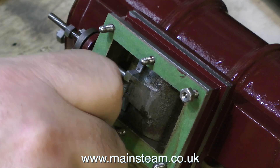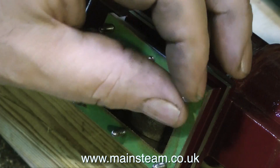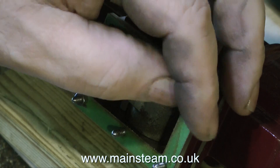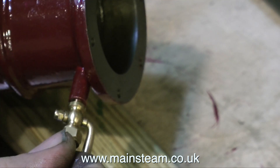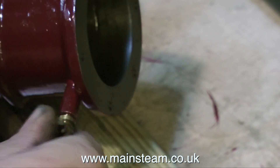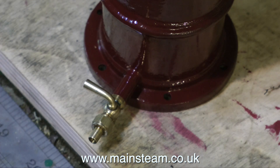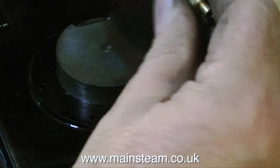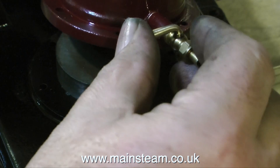I'm taking notice of the 'T for top' marking on the steam chest, because that orientation seemed fine — it wasn't leaking in the first instance. Once the steam chest cover is lightly held in place with a couple of nuts on each corner, it's time to fit the drain cock. This drain cock is a little bit of a rattle fit, so I used some Loctite to hold it in place — not 638 or 603, just the hydraulic seal, which is 542.